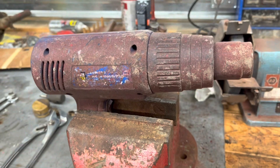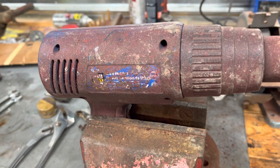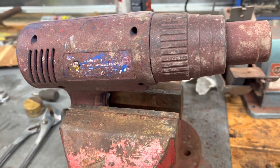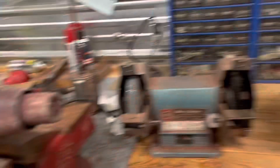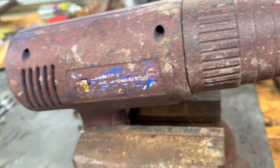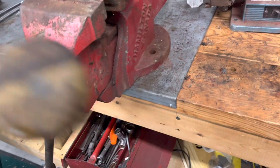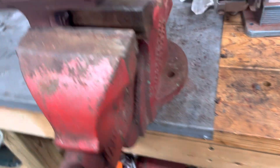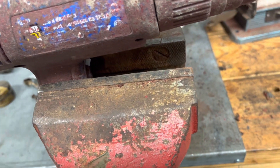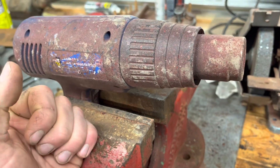I actually discovered a little split in mine, so I'm going to solder that back shut. I think I have rosin core solder and a soldering iron somewhere in my tool collection — it's been a long time since I've done it but it can be done. Another way you know there's a pinhole: take your float and shake it — if you hear liquid inside, that's a sign. I had quite a bit of gas in there. I already boiled some of it out.